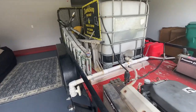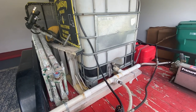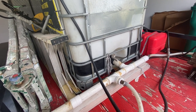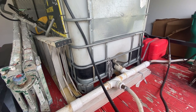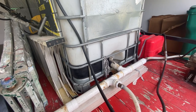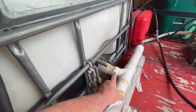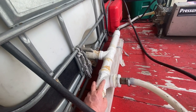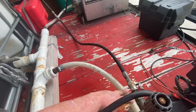Now I want to get to how to plumb these tanks — it's really simple. If you have a water tote, you have a two-inch ball valve right there with a male fitting. A male fitting means it pokes out — it's nothing that you screw inside of it. You just put a two-inch threaded sleeve over it. Once you get that two-inch sleeve on it, half the battle is over. Then you can go ahead and make your connections, put a tee off, and then go to the end and I'll walk over there and show you that in more detail.